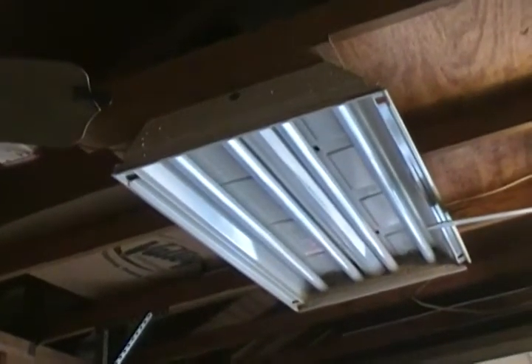I do know that this light right here I will hook to this switch, because this light is hooked up in a kind of shady way — I don't like how they've done it. They've got it attached to this light over here that no longer works, and run with some stranded wire just looped around and going over some nails on top of the wall. I noticed there's no grommet of any kind — that wire could actually short very easily. So I'm gonna disconnect all this wiring here.